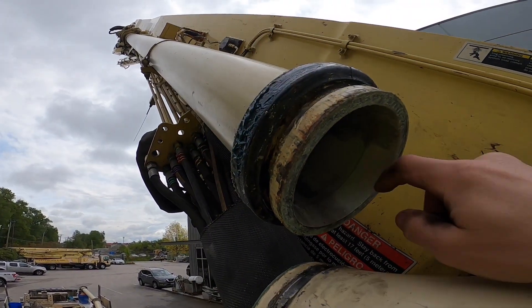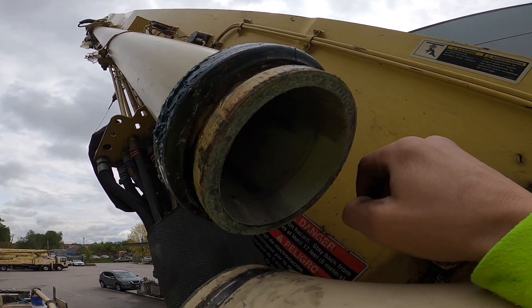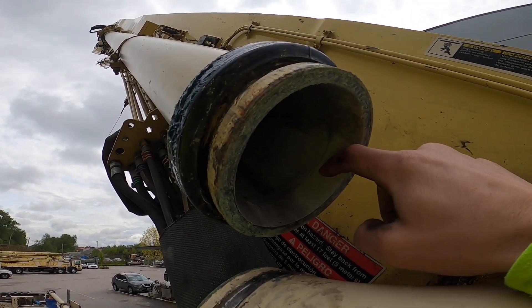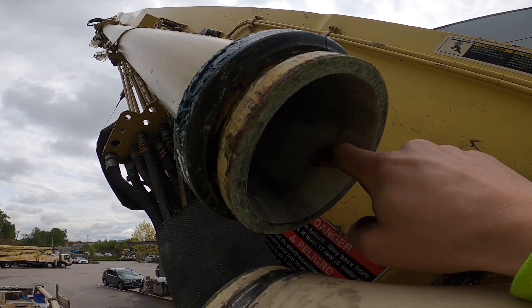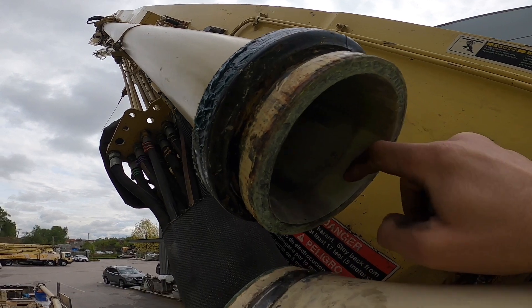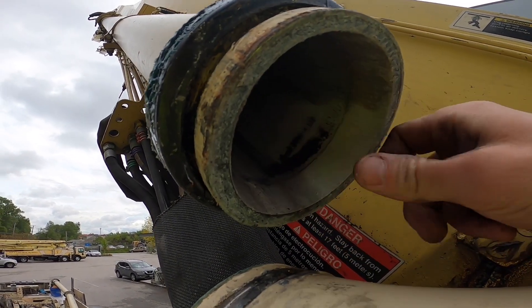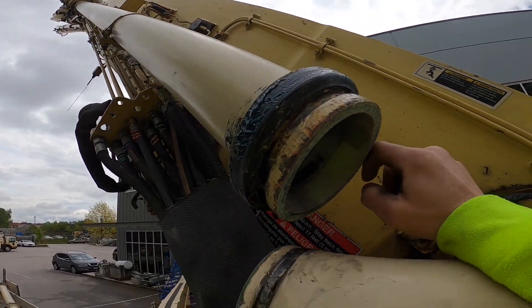So I think on this pump he's been doing a six-inch softball and then a five-inch softball behind it with water in between. I would recommend using a five-inch hardball on the first round with zero water, and then a ton of water and a five-inch soft sponge — and you wouldn't get this little layer of cream. I mean this isn't gonna hurt anything, but it could be a bit cleaner.